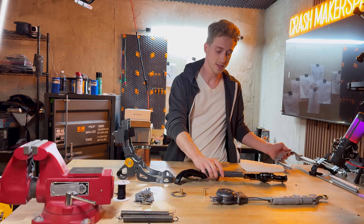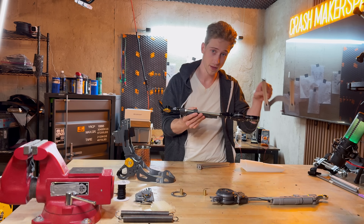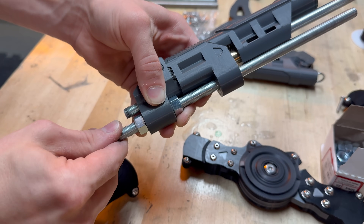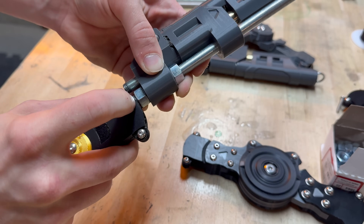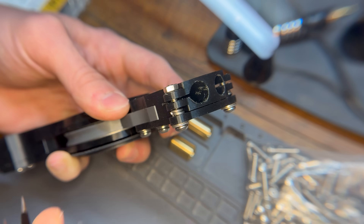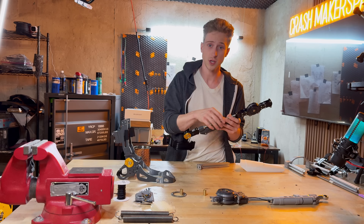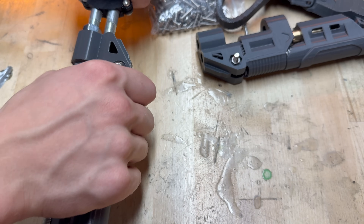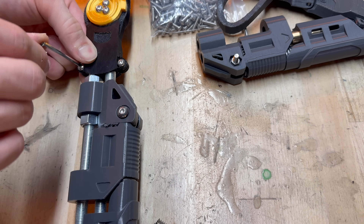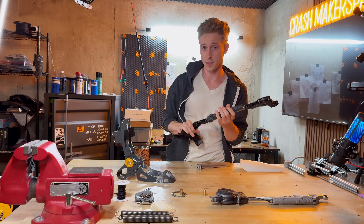That's where I switched over to steel threaded rods. These are really strong, and by using two of them I could still get a pretty flat part — much flatter than the extrusions. I can use a nut to adjust either tension for a spring or to adjust where I might mount an armor panel. The bite on the nut is a lot more impact resistant than the friction-fit snap-ins for aluminum. I just created a break in the hinge mount which allows a little space; when I push these in and clamp down, the threads in the rod bite into the casing, making a very strong connection point that's much thinner than the aluminum extrusions.